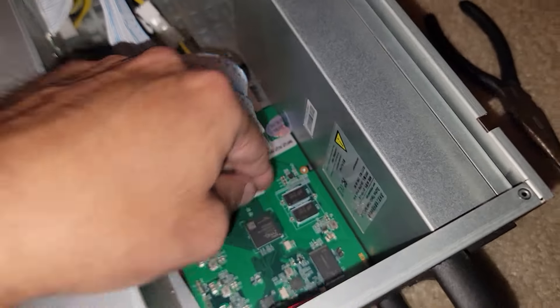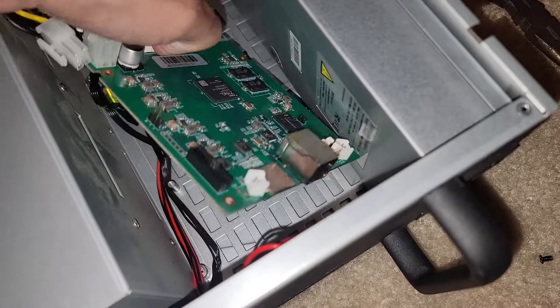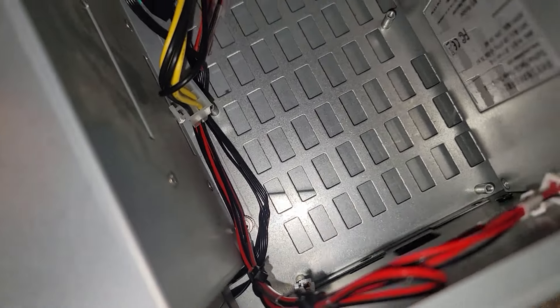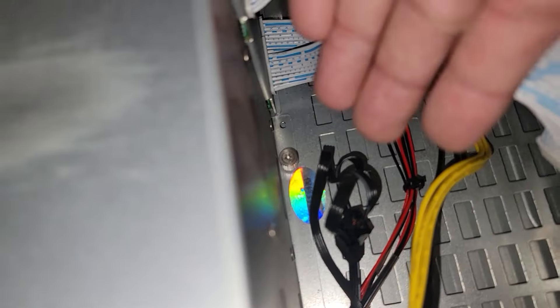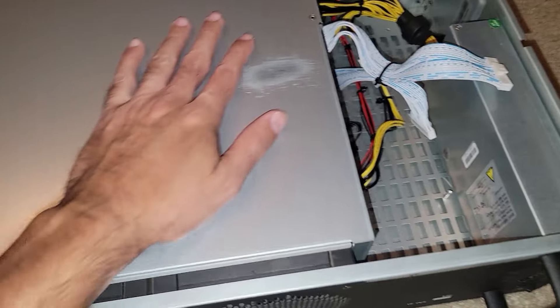Do not tug and pull these out by their wires, otherwise you'd be hating it — you don't want to break the pin out. Now we should be able to carefully remove this control board and replace it with the new one we just got. Some of the wires run underneath the control board, so be careful when setting everything back in that you don't pinch anything. You can also see some screws there — those screws are holding in the secondary chassis that houses the hash board. This metal frame that goes over the hash board is held in by those screws, and we can see more of them down here in the very bottom.